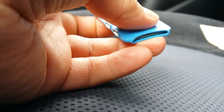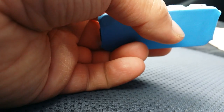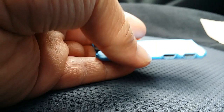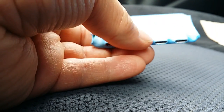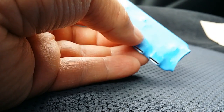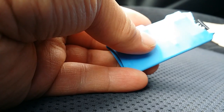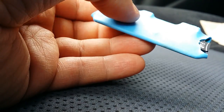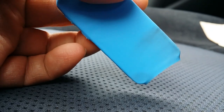The camera can still be plugged in, the SD card is still removable from the bottom. I used a hair dryer, but you should use a heat gun, which blows low wind and high temperatures — more appropriate for this job. You can also use a lighter, but it will blacken the tubing a little bit.